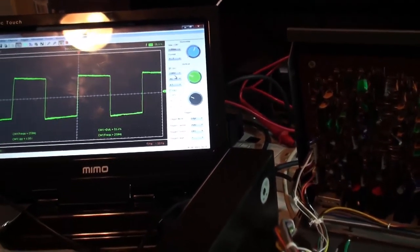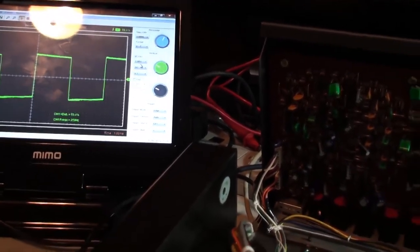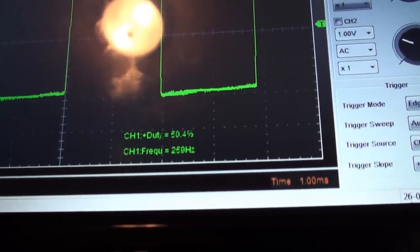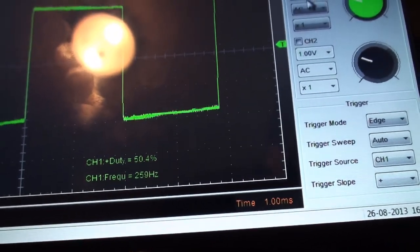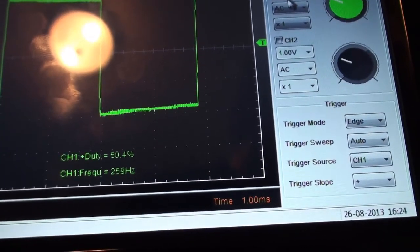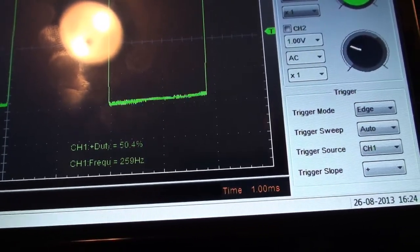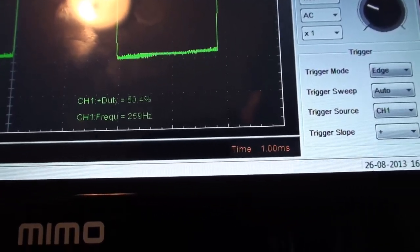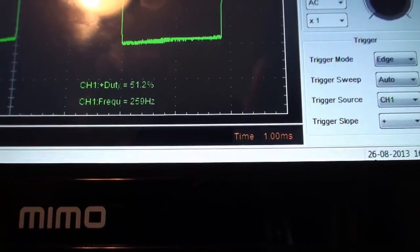Really, all I've got to do is confirm that the rest of the duty cycles are within 48 to 52%. That's the tolerance, 48 to 52%. So it's actually already there, very, very close. However, wait a minute, this is VR31. So VR31 covers everybody. Okay, so I obviously don't want to be tinkering too much, because I could over-specify one of them.